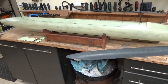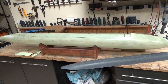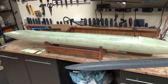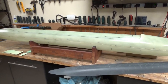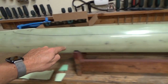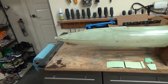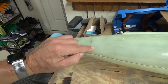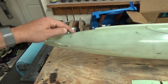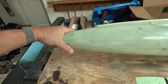The hull itself is just under six feet, so we need to start getting creative. Typically when you do an RC submarine cut for access to the interior, you perform what is called a Z-cut — it comes up underneath the bow along the split and then up on the upper hull like a Z. There are some nice convenient lines here, and if you're building this boat and don't need to worry about fitting into a case, you can use this because it gives you easy access to all of your rear control linkages once the pieces are adhered together.